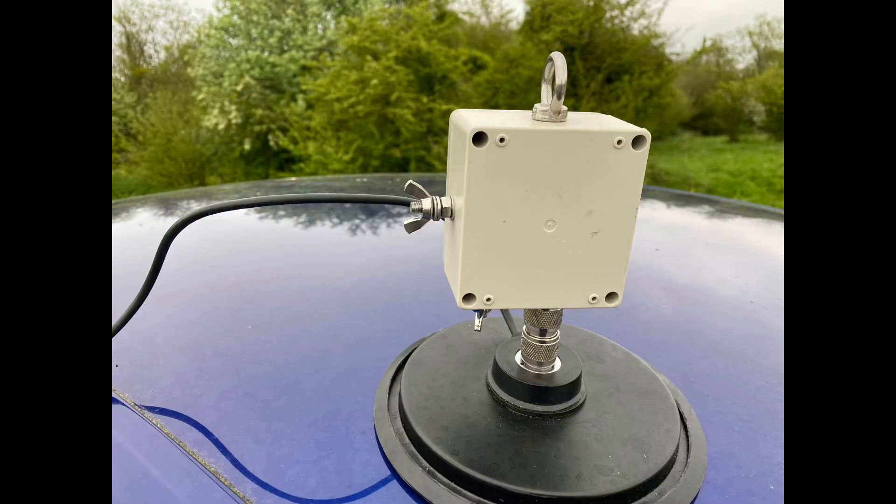Still 16 feet of wire — five meters — we'll have a go at 10 meters. My theory is that this antenna is going to prove long on 10 because of the loading effect of the end-fed half-wave transformer. Interestingly, the SWR is about 3 to 1 on 10 meters, but on 12 meters that's where the sweet spot is — 24.9 MHz, flat, about 1.1 to 1. Great SWR on the 12 meter band, so clearly there's some end loading here.